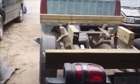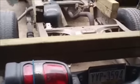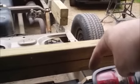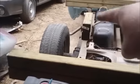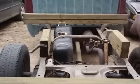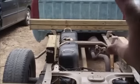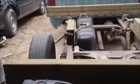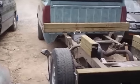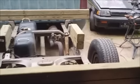That's just, I think, how I'm gonna do it. I'm gonna get long carriage bolts, and I'm gonna bolt straight down to the frame there and here. I'll probably put 2 in each of those. I'll have to drill holes for those ones in the frame, and then I'll put 1 there and 1 there, long carriage bolts to sandwich them together. And then the rest of it, I think I'm going to put together with lags. I'm going to get a bunch of lags and slam them together.